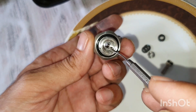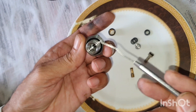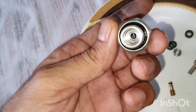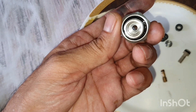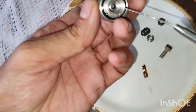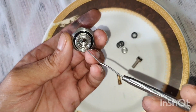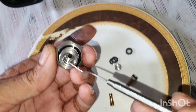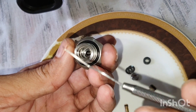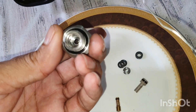When I replaced this O-ring in the groove — that is 4mm x 1.5mm — then finally all issues got sorted. So this is for you. You know, O-rings over time get brittle and develop some leakage, so this issue is going to come before you also. I want to share it so you don't waste your time and don't get frustrated. It is tricky to uninstall this O-ring and even more tricky to reinstall it. But once you know it is here — the real catch of this regulator — you can do it. It will take time learning to put and remove the O-ring here, but ultimately if you do it properly, you will get it solved.